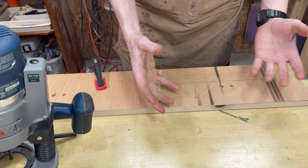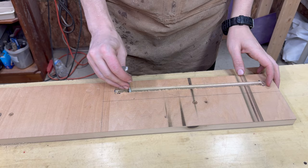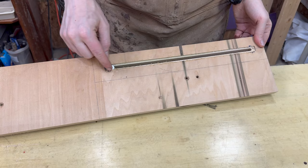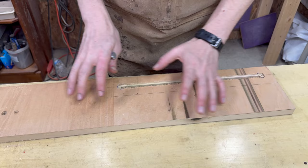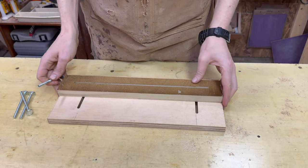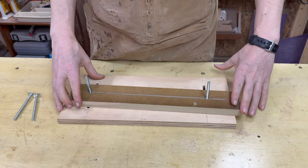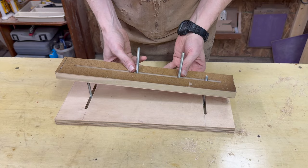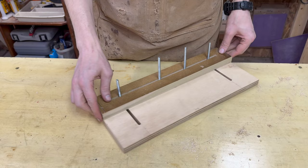Once routered out, same system as before: one-quarter inch all the way through, place your bolt, mark with a Sharpie on either side, take away half the Sharpie line, go all the way to the end, chisel out the little bits in the corners, test fit. If your test fit is good, cut the fence out — we're done needing to hold it down as a larger piece. After cutting the fence, cut the base out. The concept: the two T-bolts feed through the bottom holding the movable fence which can move at an angle, the other two T-bolts go through the bottom of the fence to hold the accessories, and everything pivots. We'll also put a little backstop on this.